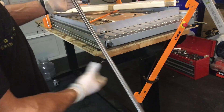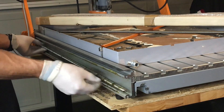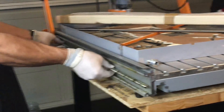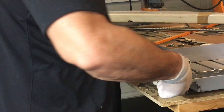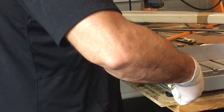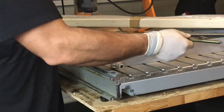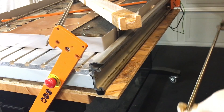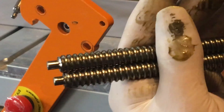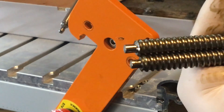Okay so here they are — the two lead screws. They're both identical in size. So what I'm gonna do first, I'm gonna take this lead screw out. I went ahead and already took everything out from the other panel. Now I'm just gonna loosen up this screw back here. The bearing will come out guys, be aware about that. There's lead screw number one. Now this is the one I was having issues with. I'll compare it to the other one — this was a little bit longer than it should be.